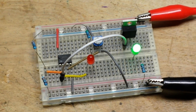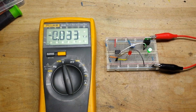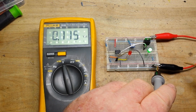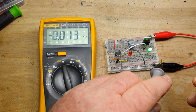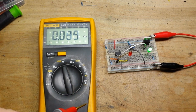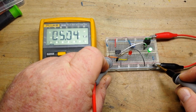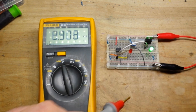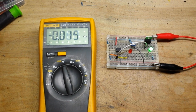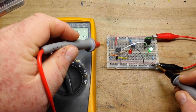All right, so there's our input voltage: 10.07 volts. Here is our cutoff voltage: 5.04 volts. Here's our circuit voltage — it's at 3.3 volts. Everything is good, right? Okay, so then let's take a look at the voltage at our output pin as well.